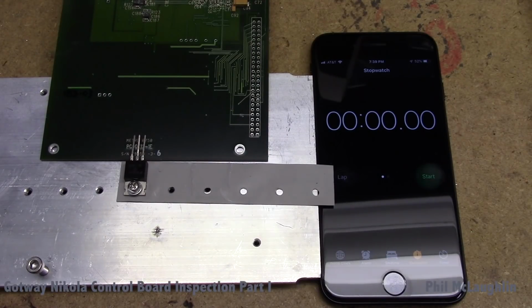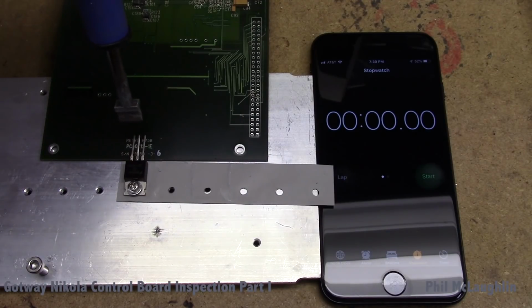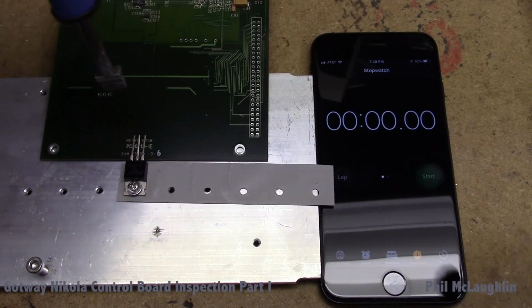As we said, we've just now mounted the package that's simulating the MOSFET onto the board. It's torqued down pretty good onto the pad, mates up really nicely. Now you see I have a piece of PC board next to the leads, which is really meant to be a thermal insulator so that I wouldn't be pressing the leads directly down onto the heatsink, which would skew the test. So in this case, that should make a pretty decent thermal insulator and not mess things up. But of course, I'm going to do the following tests after this in exactly the same way. The previous one with freestanding was a little bit different because there wasn't a nice solid attachment point. But for this, basically, we should be in pretty good shape.